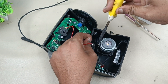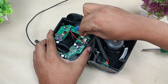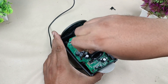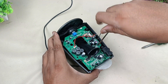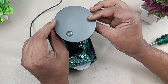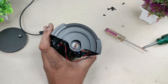Now I'm going to remove the wire of the speaker — done. Let me keep this aside. Now I'm going to remove this motherboard. There are four screws. Let me remove this controller by just pushing it to the side — it will come out. There is also a nut here that we have to remove to take off the motherboard.